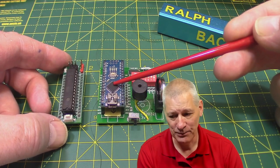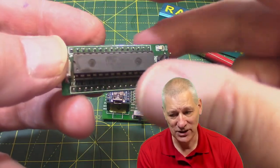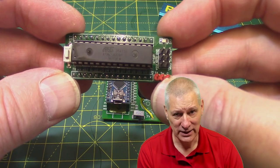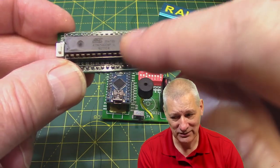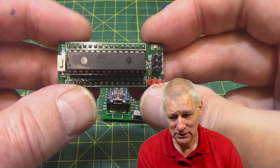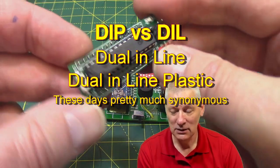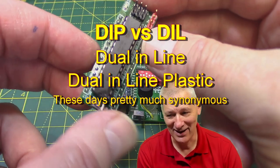This little device - I thought, well, if the power on this board is sucking too much current - remember I said it had something like 6 milliamp power current consumption initially - by doing a few things it went down to something like 4 when I took out the resistor for the power-on LED. The rest of it is probably being taken up by all the other gubbins underneath this nano.